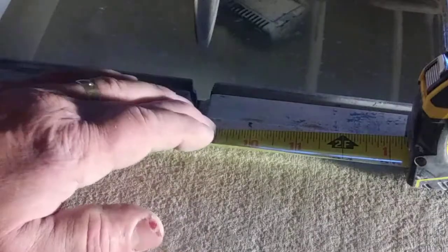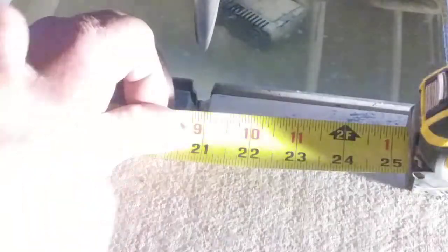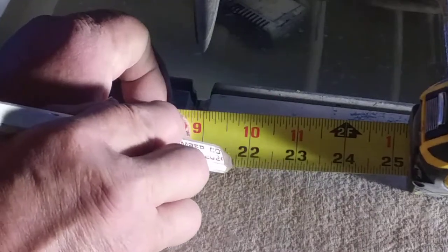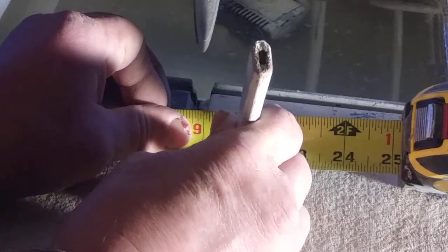21 3/4. That is 12/16, which is an improper fraction. But knowing that's important when it comes to understanding your measuring tape and getting accurate measurements. 21 12/16 is 3/4. You don't want to say 12/16 except for in your head. You acknowledge what that is in 16ths. But that number is 3/4.